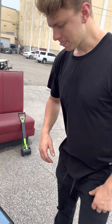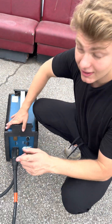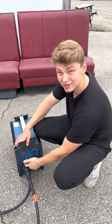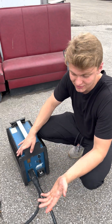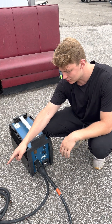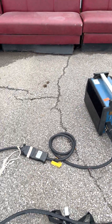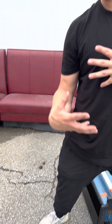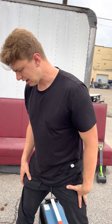So I have the key point — pins to power. Remember that: all the time, pins are always going to power. That's a 60 amp 220 right there. Make sure you always label it if it is 220, because if you ran a 120 like that, it wouldn't be good. It's wired differently — 220 has two hots versus 120 having one singular hot.